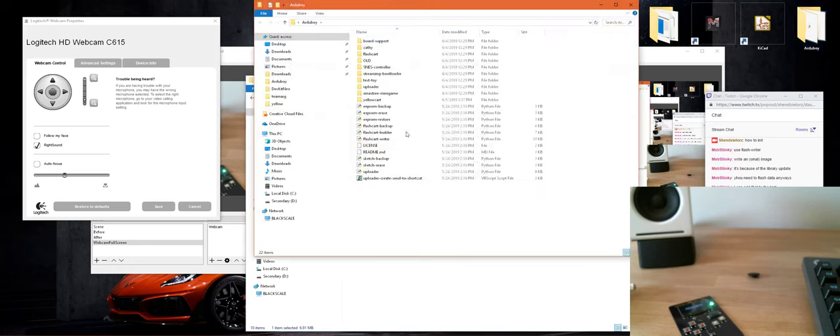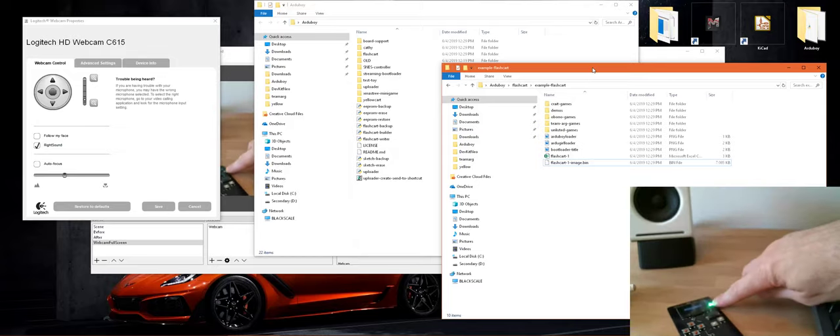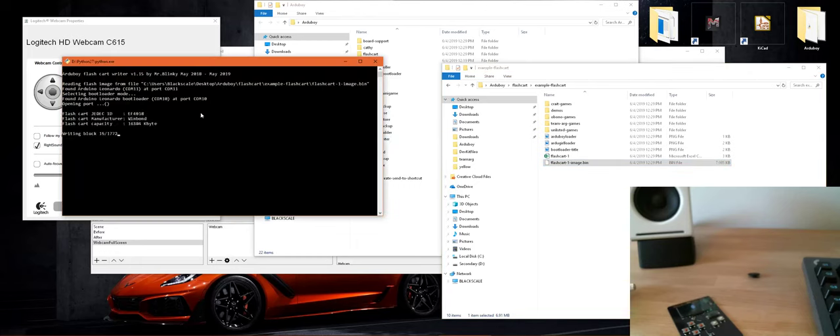Okay, so let me open this. What Mr. Blinky is telling me is the reason why this is not running, this should be the red LED flashing, is the library is checking to see if the flash cart is initialized. It is not initialized because there's no cart image. What I just burned onto there was just raw data. But the library is looking for a signature that comes when you load a full cart with the menu and all the addressing for the different games, which is within this flash cart image here. That will allow the library to work. So let's go ahead and do that. We'll drag this fully compiled flash cart, which I'll show you how to make later, into the flash cart writer Python. It'll take a little bit of time because it has a video and stuff in there.